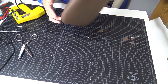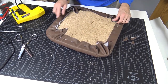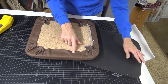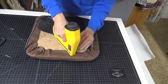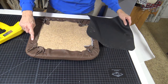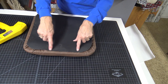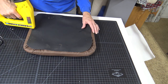First corner done. Continue cutting and laying down the corners. Now we're ready for the base piece. Some areas still have a little gap between staples — you can go ahead and fill those in, or the base piece will be going over it and stapling all the way around. If you don't have one of these pieces, make sure there's a staple about every inch all the way around. The metal frame will go around the exterior, so staple along the edge pretty close.